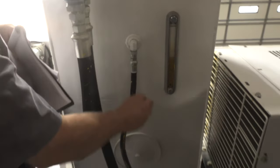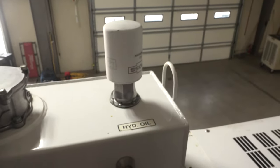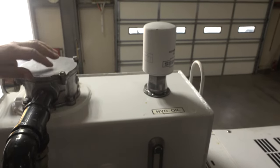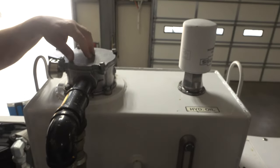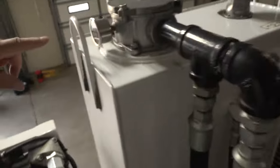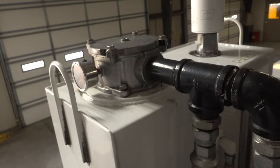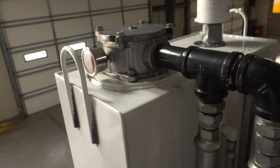This is a filter for the air intake. Take that off and you can add oil through there — there's also a filter in there to filter the air as it gets pulled in when the fluid cools, and pushed back out when it expands when it's hot. This is your return filter — a six-micron filter. There's a restriction gauge on this side: when you're in the green it's good, yellow means it's about time to think about changing it, and red means you want to change your filter.